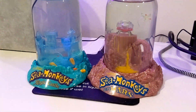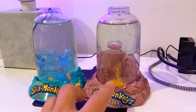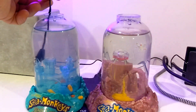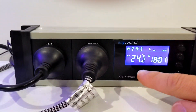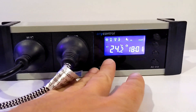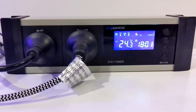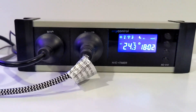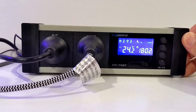What I'm using it for — my kids got some sea monkeys and said, 'How can I geek this up?' So I've got a heat mat, being winter coming up, to try and keep these fellas a lot warmer. The thermostat has a waterproof thermometer that detects the temperature. I've noticed this unit reads about 1.3 degrees cooler than actual, but as long as I know the tolerance I can adjust around it.